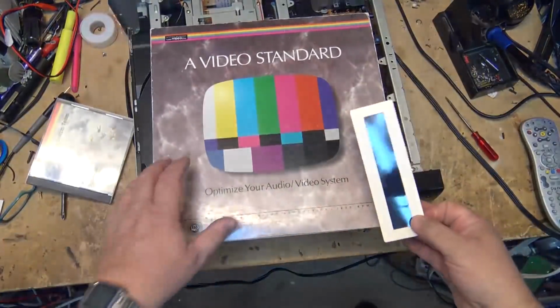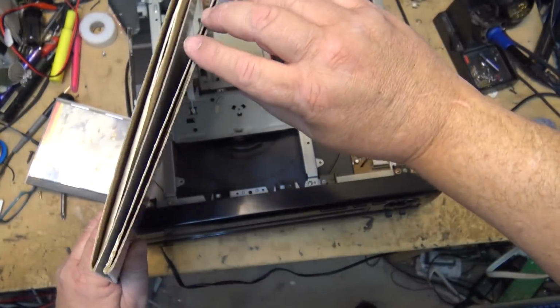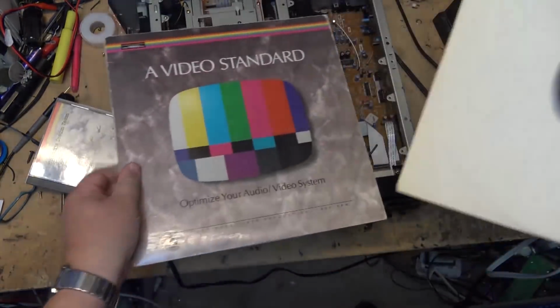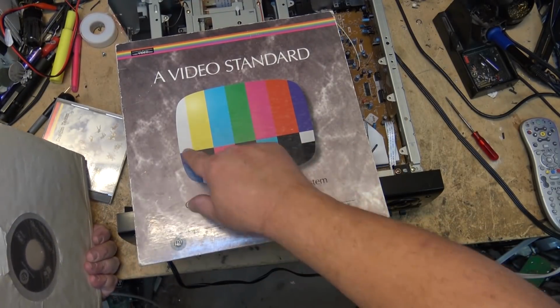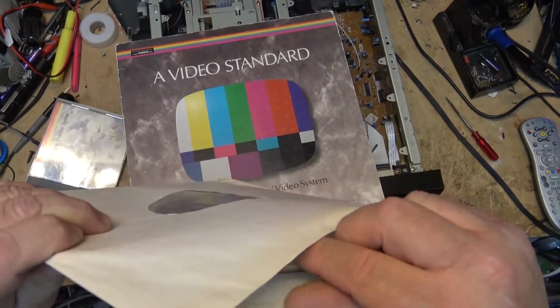This is the same type of primary blue that would have been on television camera tubes back in the tube camera days. Anyway, that's how you set them up. Professional monitors, they just turn the green and red guns off, so they're only looking at the blue gun. And then they can set the color intensity exactly the same way on a professional monitor.